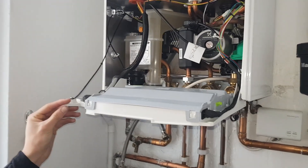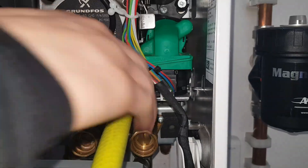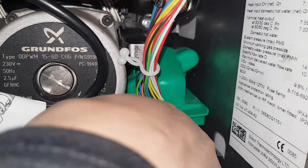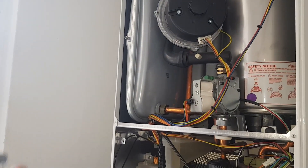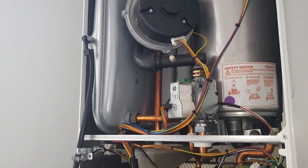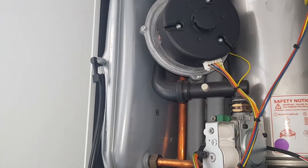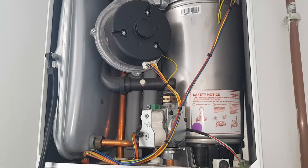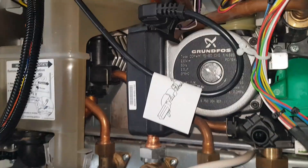You've done this before Miles, haven't you? So where's the drain pipe going? That's it there — now we're just turning that, a bit of a twist, anti-clockwise. Water running out now — that's it. We're going to do the expansion vessel as well. On these Worcester 30i's, for some reason they're very very difficult to pump up. All our other expansion vessels are not a problem, but these Worcester 30i's — don't know if you've noticed it, drop me a comment, I'd like to know your feedback. We can now close that off, just going to remove that pipe.